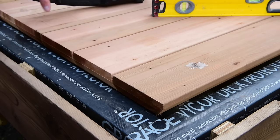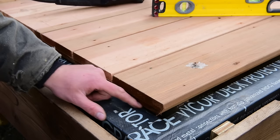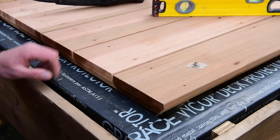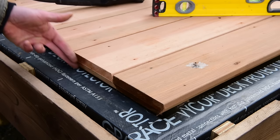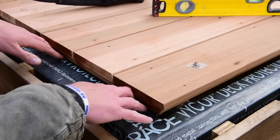What I've done is bevel these back using my track saw — or you could use a circular saw with a piece of plywood as a fence if you don't have a track saw. I just beveled these back so any water and dirt that goes down in there will get washed out through the little gap. I might cut it a bit wider to about 3/8-inch so water flushes anything out down through the crack and drains out the bottom of the deck. This should increase the longevity of your deck boards. I've left this cedar raw because it's old-growth red cedar — it'll last 50 to 60 years before it starts to rot.